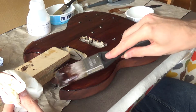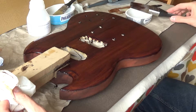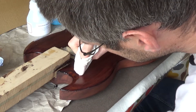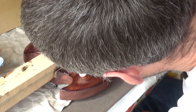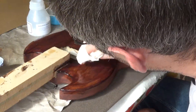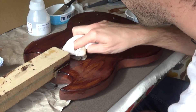Okay, there's one more happening up there. All I'm using is just the glove - just using the latex glove to try and do this, just to keep my fingers off it. But there's a ridge, there are ridges in the lacquer, and all I'm doing is just kind of scratching at them to try and knock them down and steal that stain away. Maybe this is the way to do it - maybe just applying the lacquer with a rub and just accepting that some of the stain is going to move, because the color that's coming out is actually quite a nice color.